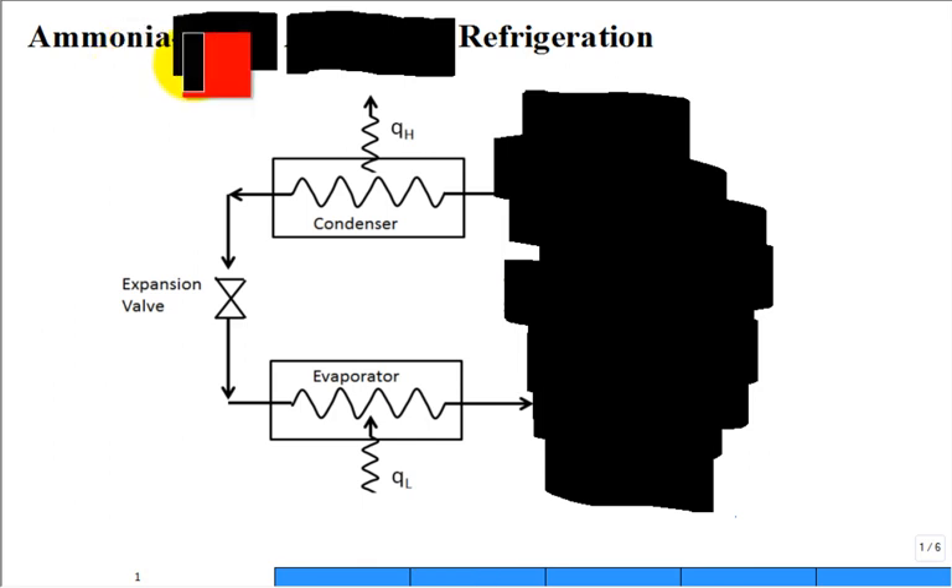Think about this — I covered up boxes here. We're going to talk about ammonia as a refrigerant. What's ammonia? NH3. So ammonia can go through the condenser, be cooled, pass through the expansion valve, and be ready to evaporate in the evaporator. It's just like refrigerant 22, 134A, or 410A. This is how it would be used.